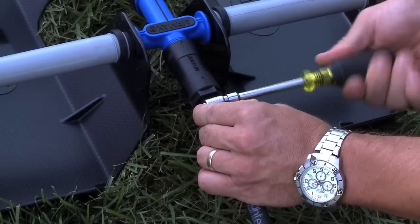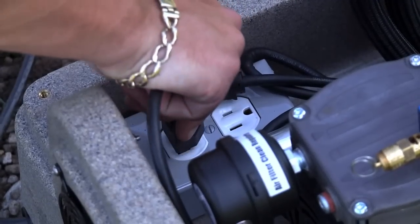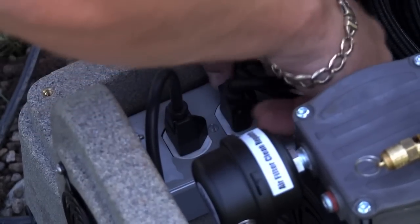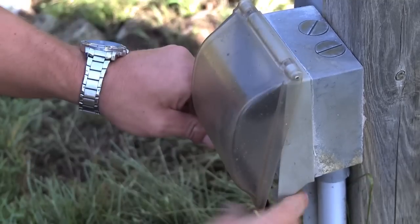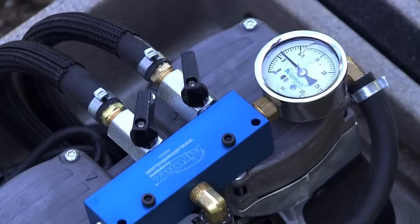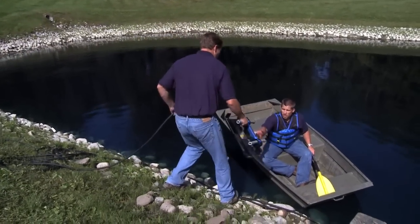After the airlines are connected and the diffusers are assembled, it is time to prepare your system for startup. Plug your compressor and cooling fan into the power outlet inside the cabinet, then connect the power cord from the cabinet to a standard ground fault circuit interrupter (GFCI) outlet. The system should now be running.